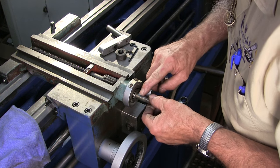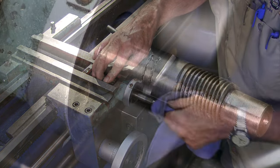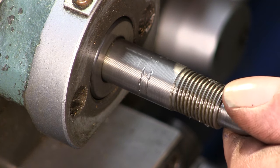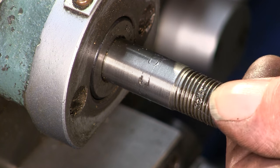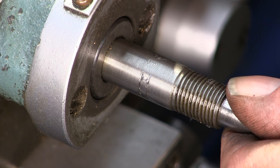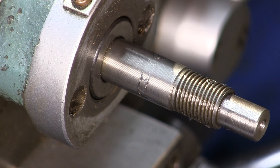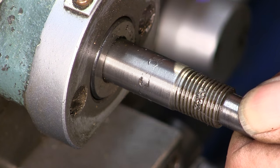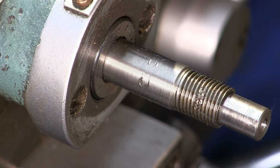I'm going to take a file and lightly file it. Let me zoom in so you can see — right there are the pecker tracks from setting that dial and locking it down. Over-tightening things creates marks like that, and really for something you want to adjust and move around on a regular basis, a dog point is not a good contact. And that right there is where the locking collar was coming in and locking on there.